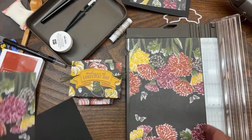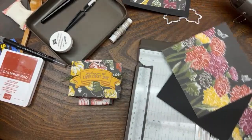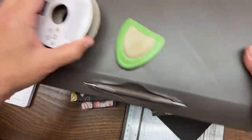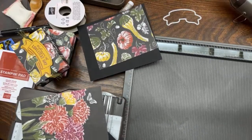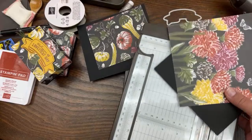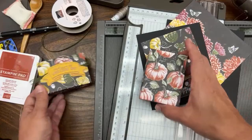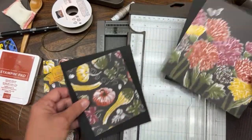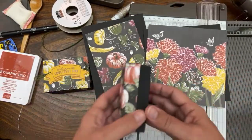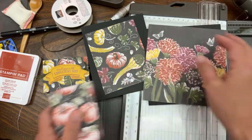This six by six piece illustrates the point. If you were to just create a box and you had the same size top and bottom - in this case six by six - you would never be able to get the box lid to fit over the bottom. You need the box lid to be a little bit bigger than the bottom. So if everything is the same size, you always need to take your bottom piece and cut a smidgen off.